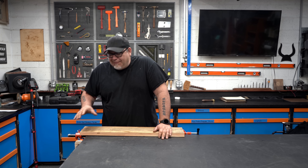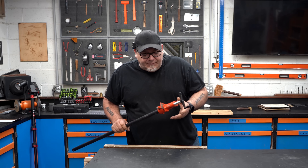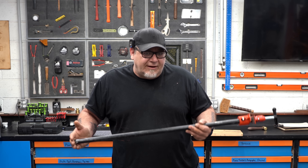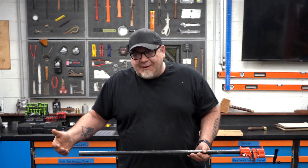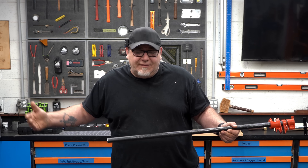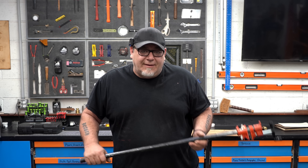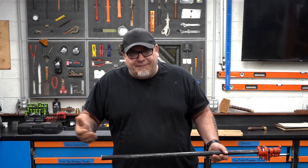Pipe clamps are pretty inexpensive compared to parallel clamps — about half the cost. When you buy a pipe clamp you're just buying the head and the tail, just those components, then you go grab some pipe. If you're buying pipe from Home Depot or Lowe's, a 36-inch threaded section costs about $30. But a 10-foot piece costs about $40 and is threaded on both ends. You can get three 40-inch pipes out of that 10-foot section, so you're getting a little more than 36 inches and paying a lot less. Many stores like Home Depot or Lowe's will cut and thread it for that $40 price point, so it makes no sense to buy a 36-inch one for $30 — just buy the 10-foot one and have them cut and thread it. You've got three of them for about $10 more.